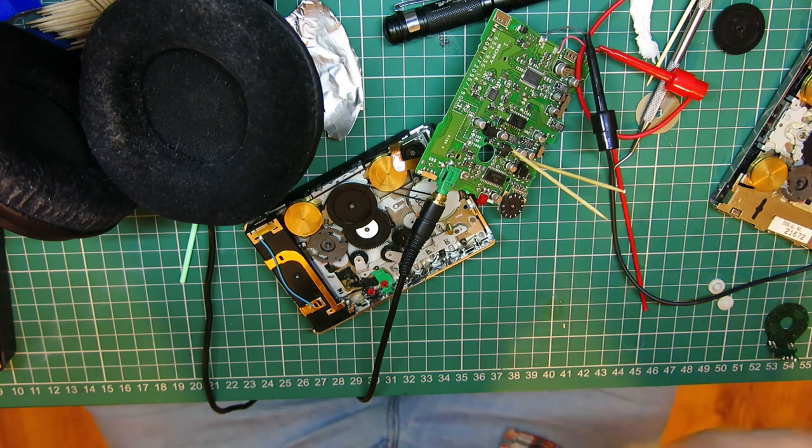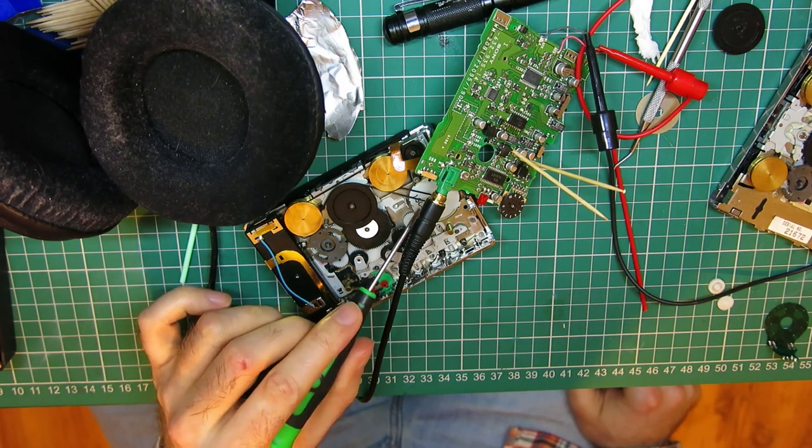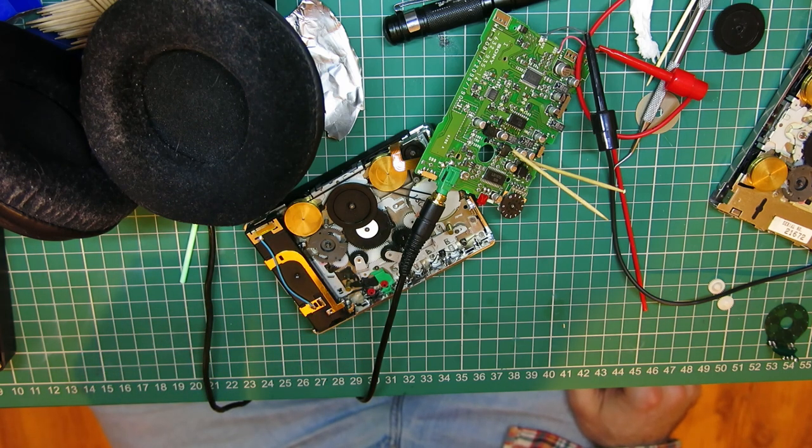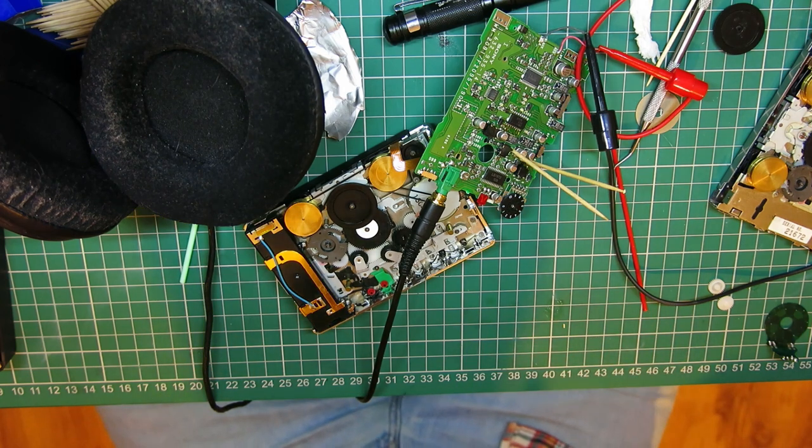and connected the power, and I am convinced this motor is going to need replacing. I think it's got the same corrosion as the very first one, the EX49 that I did, that after doing everything to it, the motor was starting to fail. It's drawing a bit too much current, and it's unstable at 1.2 volts, and it just doesn't sound right. It sounds like it's got the corrosion problem. I'll show you what that means in a second by showing you on the spares unit that I've stripped down,